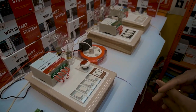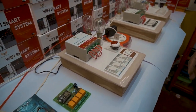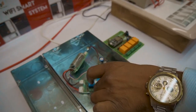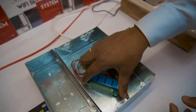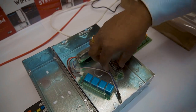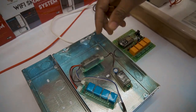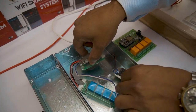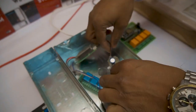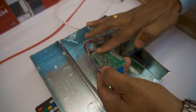We have multiple products. This is the concealed box retrofit model — it can be installed inside the concealed box for more flexibility. It comes with four nodes, each node rated at 7 amperes, and it includes an SMPS. Input is 230 volts and output is volt-free contact. It will not impact existing switches and comes completely encapsulated with wires.